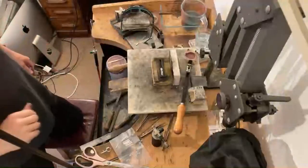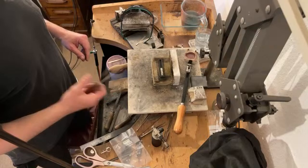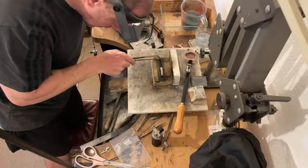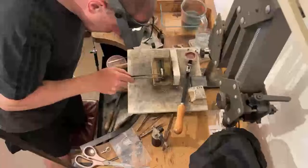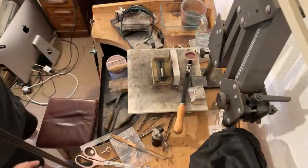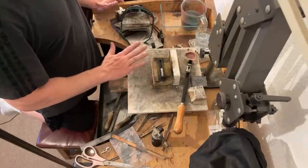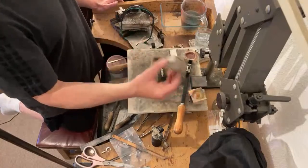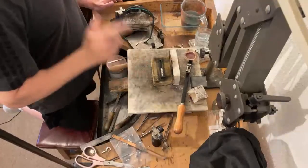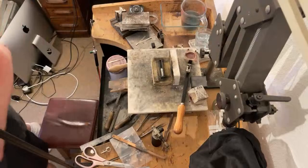Right, so we're just going to melt that up and see how it flows. I could do with a couple of pairs of tweezers here just to make sure it's moving around enough. This might fail, but at least we can give it a go. If it causes impurities in the metal, I'll make sure I've got one of the proper crucibles for white gold for the next one and we'll go again. But actually from memory, I haven't had any issues melting gold directly in graphite — but I have had issues with silver.